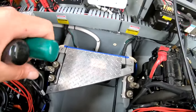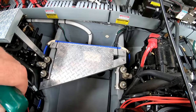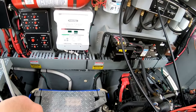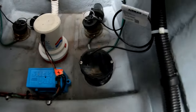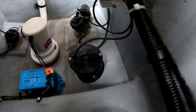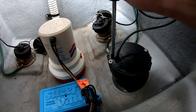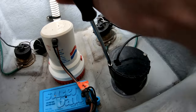If you remember me telling you, last year there was an issue with my brand new Garmin Striker — depth sounder, fish finder, whatever you want to call it. After lots of fooling around and investigating and discussions, it was learned — thanks to a viewer, a follower — that my shoot-through transducer, which is filled with antifreeze, may have evaporated or partially evaporated. I checked it last year and certainly that was the issue.